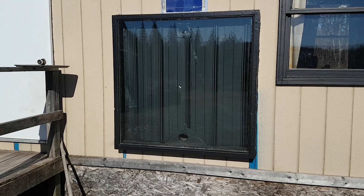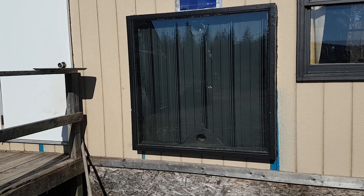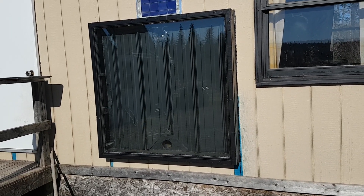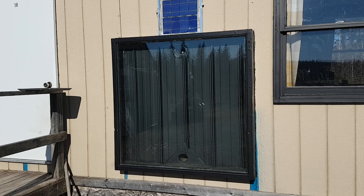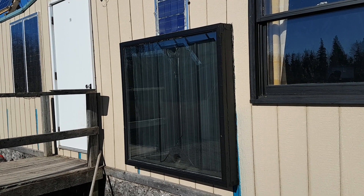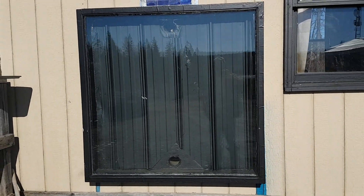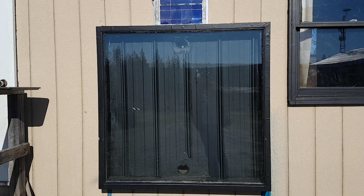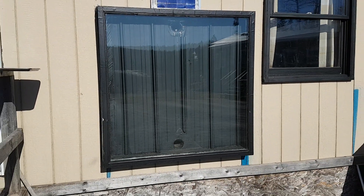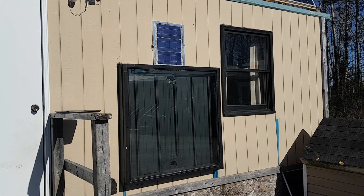Hello, here we go with a solar furnace. I'm in Nova Scotia, it's February 8th, Sunday, minus 7 outside, minus 19 with the wind factor. This solar furnace is used for heating the old man cave — she's a little bit drafty but these work good. It's free heat. On the build, it's got two-by-fours screwed directly to the wall, then caulked from the two-by-fours to the wall sheathing. On the front, the window was a double pane unit. A lot of guys are using single pane, but this is a double pane unit and they work great. The difference is the heat loss — two-thirds of the time when there's no sun value in the solar furnace, double pane retains much better.